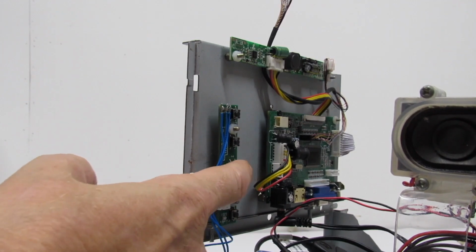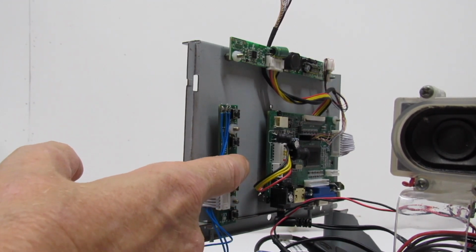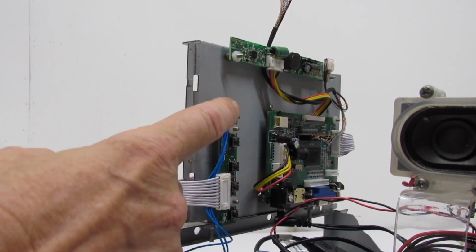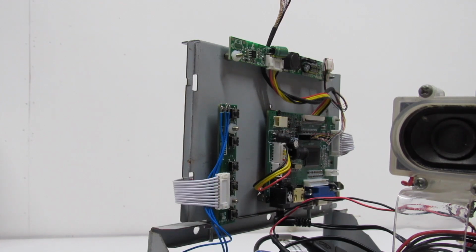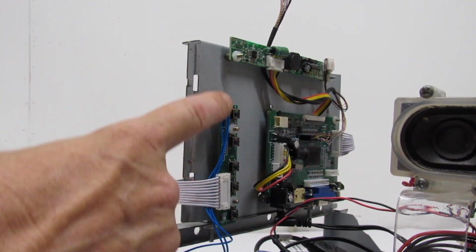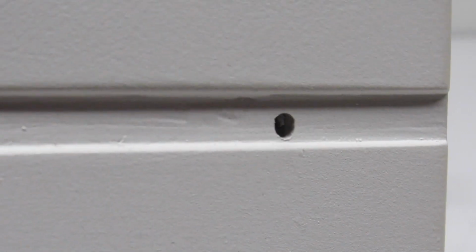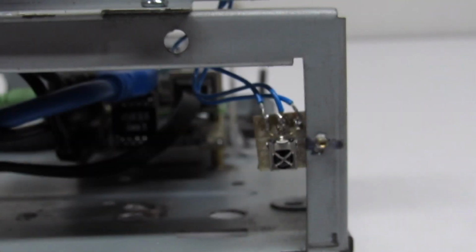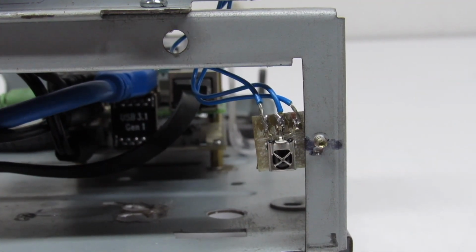Okay, this is our on and off control panel, our brightness and volume control panel for the LCD driver board. And if you look, there used to be an infrared sensor there, like that one. But I went ahead and I cut it off, and I soldered these leads to it. And if you look, there is the floppy drive manual ejection port that I left intact, and it sits right in front of the sensor. So that way we can have contact. Yeah, that turned out good.